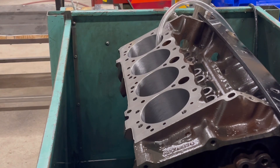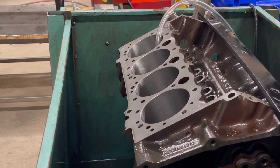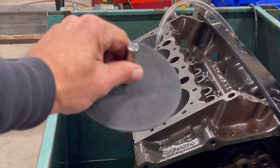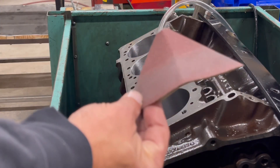So you're wondering what we use to do this. We do have a fancy old school boring bar — it's a Van Norman 777S — and it does have a tool on that you can put on there and it creates that 45 degree angle chamfer. However, not everyone has an old Van Norman bore bar. But Goodson Supply Company, who makes all kinds of cool specialty engine building tools, sells this mandrel here — it's meant for a drill. You just put it in there, tighten it up, and it has different grit chamfering cones.